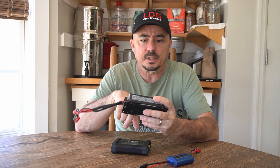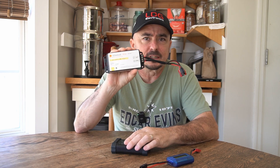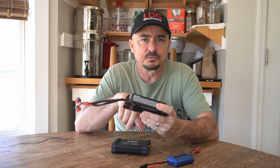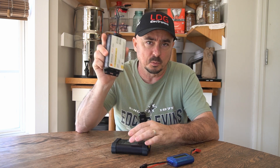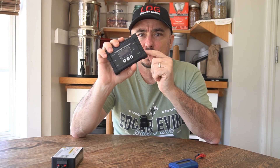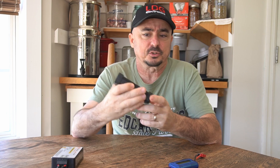The Genesun chargers are specific to the type of battery you're running — this one is specifically designed for lithium iron phosphate and can't be used with any other battery technology, although they do make one for SLA. The Power Mini 2, by contrast, can be programmed through the buttons and display on the front to charge several different battery chemistries, including SLA, lithium iron phosphate, and I believe also lithium-ion.